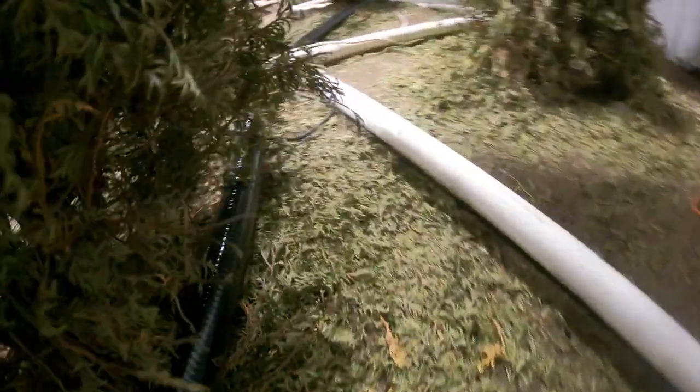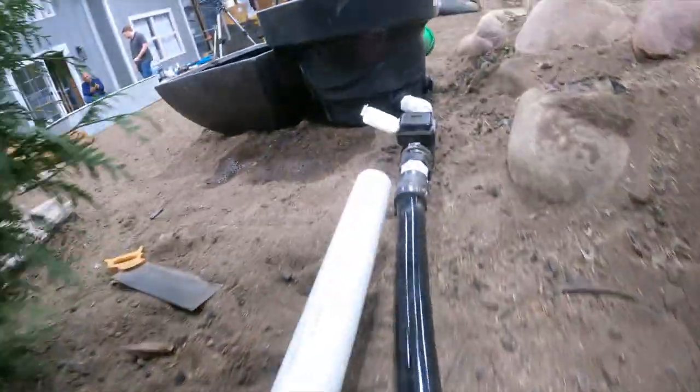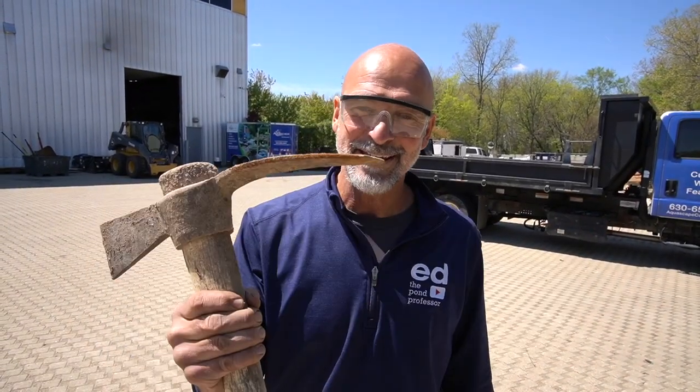The reason is simple — we don't have all of those elbows in place. All those elbows act as speed bumps, slowing the water velocity down. When talking about a piping system, we want to keep even velocity going through the entire system because it's less stress on all the joints. Look at that nice easy curve — good flow rate going through everything. We don't have all the joints, which are all potential leak points. The installation time is considerably faster — logarithmically faster, minutes versus hours. Instead of having all these glued connections, I have two: one at the Bio Falls and one at my pumping system. Obviously if you go more than 50 or 100 feet, you'll need a few couplings in between, but you can make very quick work of any type of piping installation. It's also going to conform to a wide variety of scenarios. We are ready for the next phase of our testing — impact resistance. I'm going to try it out with a pickaxe and also with a boulder to see exactly what impacts these pipes can handle.